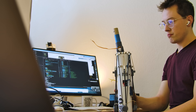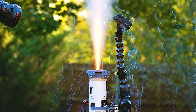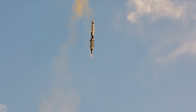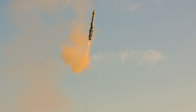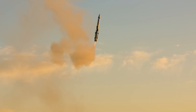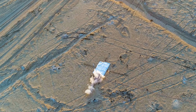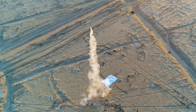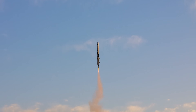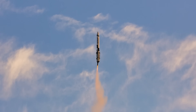In order to keep itself on course, the rocket gimbals the motor using little servos, and this lets us steer it using thrust vector control. In order to keep things as simple as possible, we actually stack the ascent and landing motors into the same TVC mount. This has some big benefits in terms of simplicity and some very obvious drawbacks. One of the most obvious drawbacks is how much this thing wiggles on ascent. Having some wiggle in the TVC mount doesn't always mean trouble, so long as you characterize that wiggle correctly. The trick is modeling that wiggle correctly in the flight simulation and working around it.